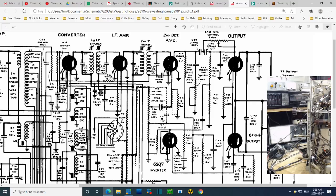So the other tone control, now I proved that out to be wired the way it's shown, and I've changed the capacitor for it. So conceivably, this is working perfectly fine. Oddly enough, when I turn it down, the sound just disappears. I'm sure I changed that. 0.007.